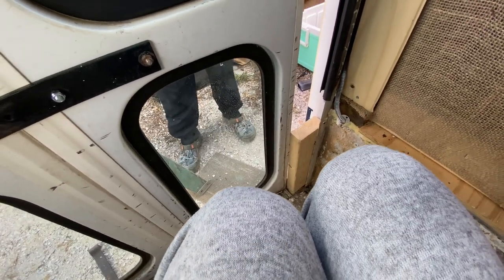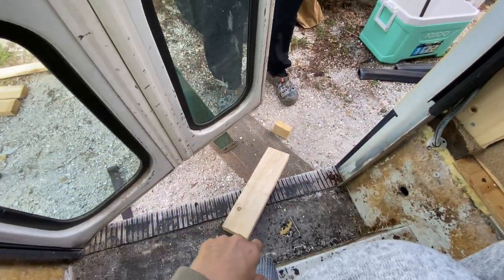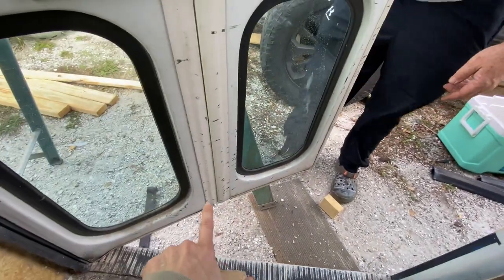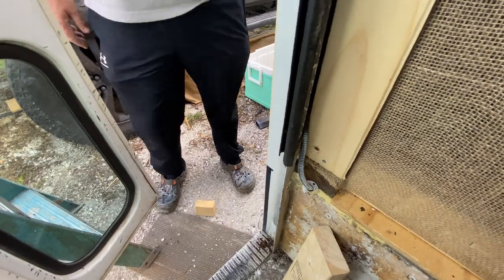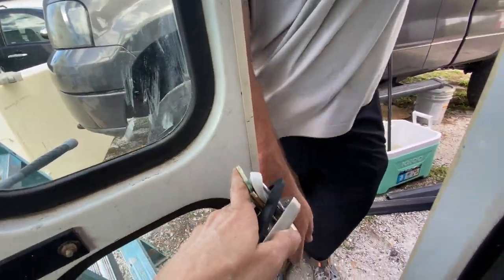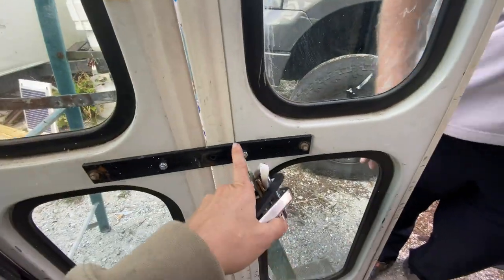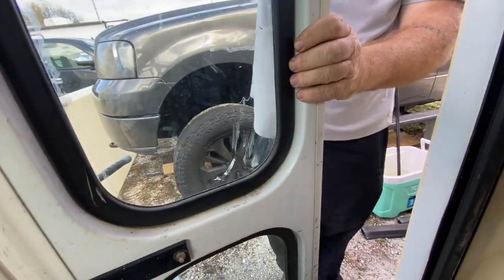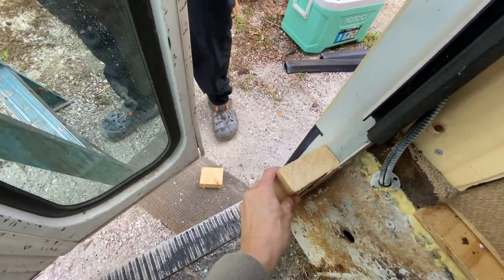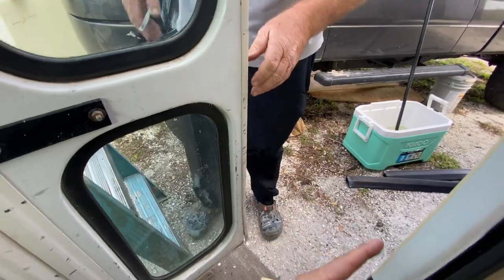So we just discussed this situation for probably about an hour — I probably should have been filming, but I didn't. The door opens now — there goes our frame. We got that part done, but now we're trying to figure out the gap. We still got to put the brace on the bottom. The lock I have just isn't going to work because there isn't enough space over here. The easiest solution — since this fits perfectly with four inches between the door and the frame — is to double up these boards and find a different lock that fits in that little area.